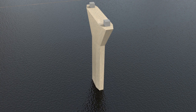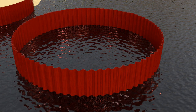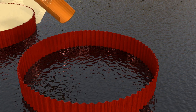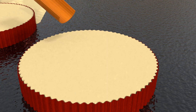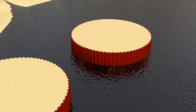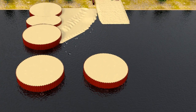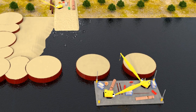The concrete seal placed to cut off water seepage may be used as part of the substructure. When the water level is more than 20 meters, cellular cofferdams are used. These cofferdams are made by driving steel sheet piles so that they form interconnected cells. These cells are then filled with clay, broken bricks, or sand so that they remain stable against various forces. The construction of these cells can be done individually in any order. When one cell is completely filled, it can be used as a platform for equipment, and other cells are constructed one by one in the same way.